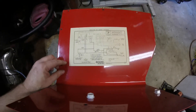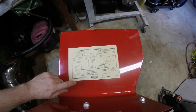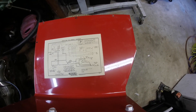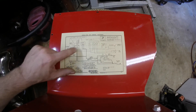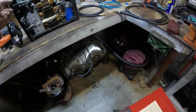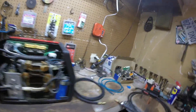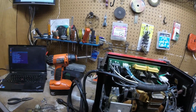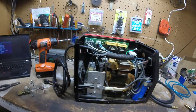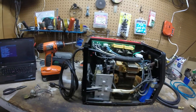As mentioned earlier, this is AC line voltage, so there's no polarity — it doesn't matter how you hook those up. I assume all Lincolns have this: once you pull the inside off you've got a wiring diagram showing everything available to you, and you can see the H1 and H2 labeled there — gas solenoid H1 and H2. Before I realized this was here I had to put a voltmeter on it and verified that line voltage was present when the trigger was pulled. I would have verified it anyway, but it would have saved some trouble.